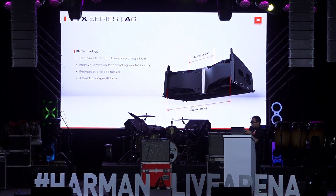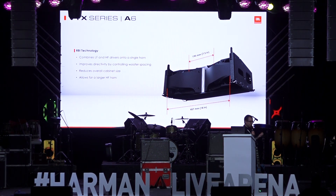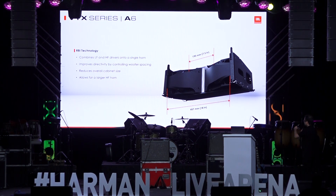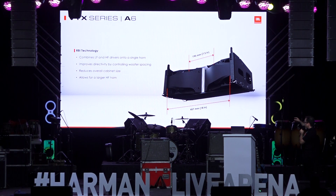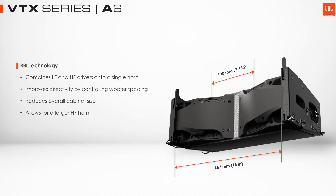The other big aspect of the A6 is the acoustic design. When we look at the A6 from the front, it's using two six-and-a-half-inch woofers and one compression driver. The big thing I wanted to do with the A6 was to create a very large horn for the compression driver — to load it correctly and have really good directivity. That's another strong aspect of the A series: they have really good directivity. You can see that the two six-and-a-half-inch woofers are loaded to the RBI waveguide, which is the plastic horns in front of the system, controlling spacing between woofers and giving us really nice directivity and control.